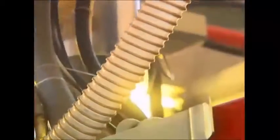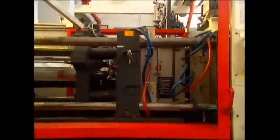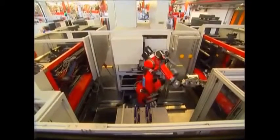The battery cases start out life as millions of tiny plastic granules. These are melted down into a sticky liquid and then injected into molds where they harden into the shape of the casing. A computer scans it to make sure there aren't any flaws — if there is even a tiny imperfection, water could get in and damage the electrics which will go inside later.